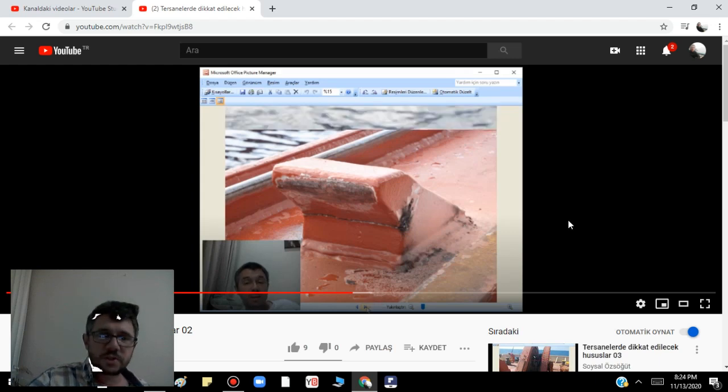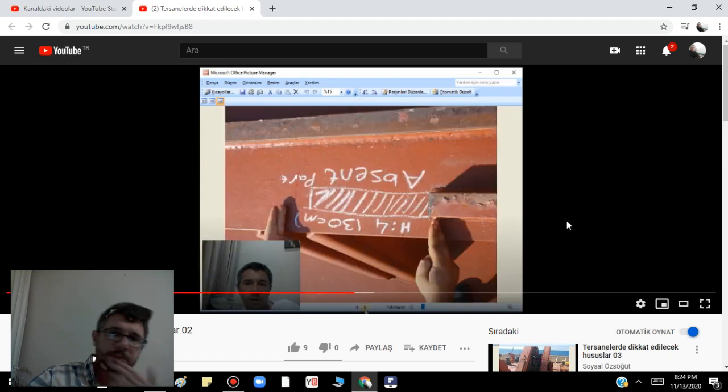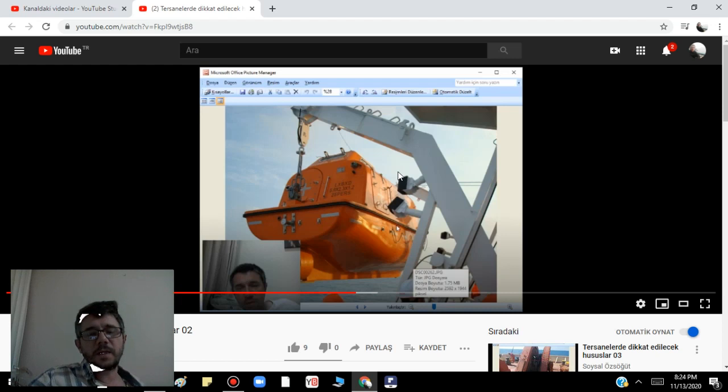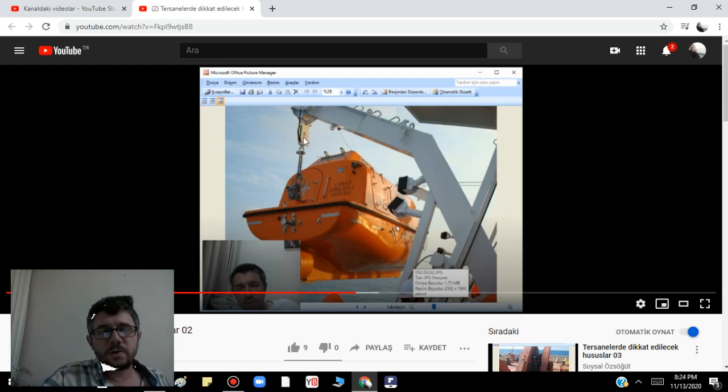The shipyard itself can make a very big mistake. I think they are not making like this anymore now. Life pods — all of them now are new generation free fall. But the davit lines, for the rough seas, has to have some wire tackles. Two sets of wire — with these two sets of wire you can pick up this in very wave conditions. Otherwise, in rough sea the life raft is moving very, very difficult to connect forward and after.